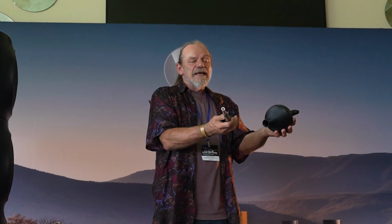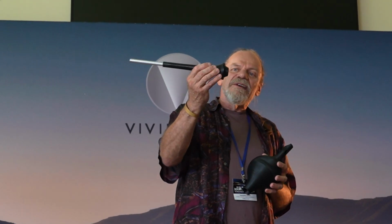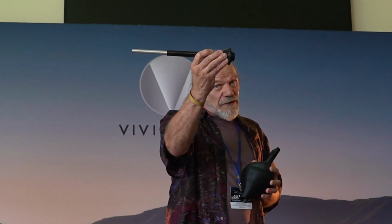If I combine the good old exponential tube with this system, you can hear that the hum is still there, the fundamental is still there. But if I blow harder, you just get a rushing noise with a gradually increasing spectrum, but no hard resonances. So the principle does actually work. And it turns out if the cutoff frequency of the exponential horn is about 4 or 5 times that of the port, you absorb all the chamber resonances and maintain your port output.